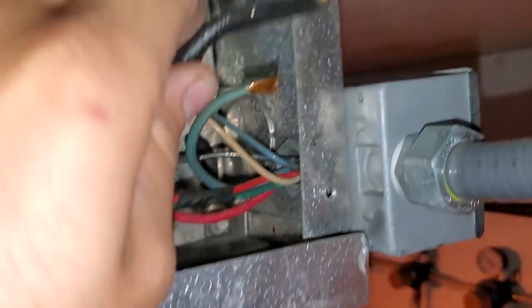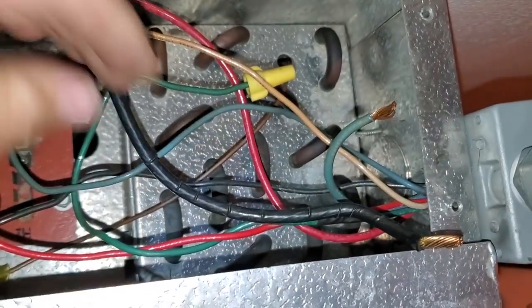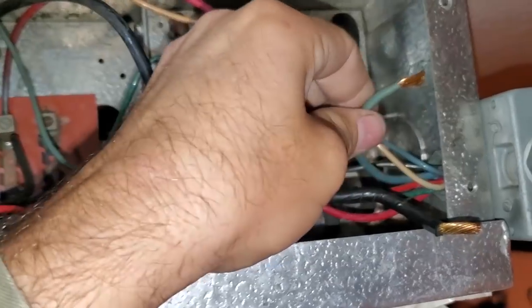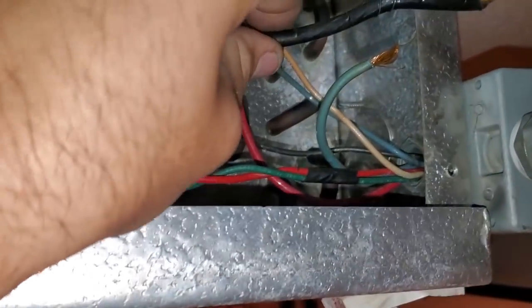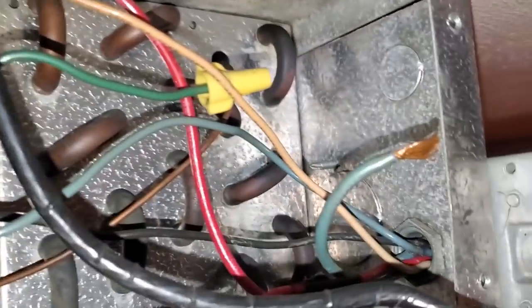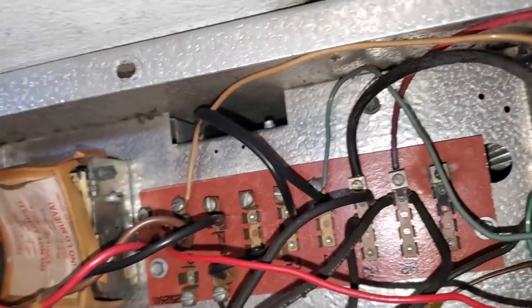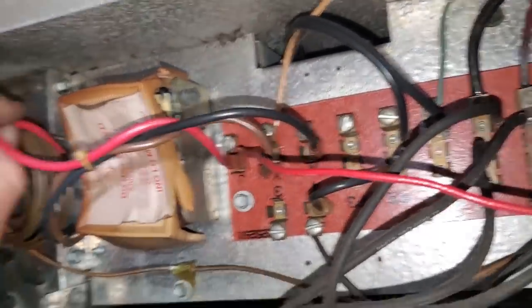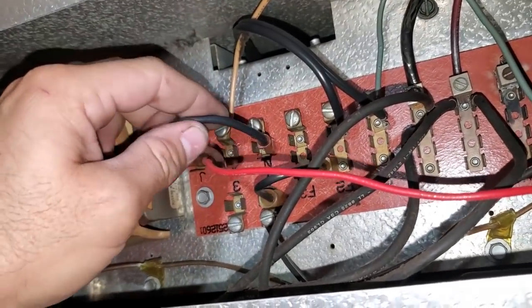So this is where we're at so far. These are the two wires — this is like a six gauge or an eight gauge, and it's really rigid too. And this is like a 14 gauge. They were going from that to that. So we're just going to clean this up and cap it off so nobody gets confused. This isn't going to be too difficult at all. And from the looks of it, this thing was never really hooked up right anyways. It's just a mess.